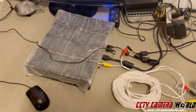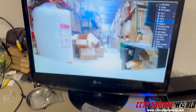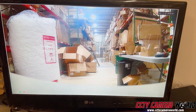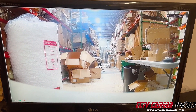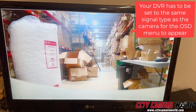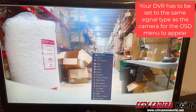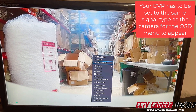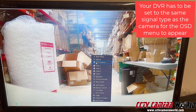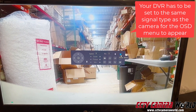Grab a DVR — make sure it's one of our DVRs or compatible DVRs. Some other brands will give you this option too. On our DVRs, you can change the signal mode of the cameras to lower down the resolution. I'm going to show you how to tweak these settings. Right-click on the camera picture while you're looking at it in main screen view — when the camera's full screen, go to PTZ controls, then click Enter Menu.